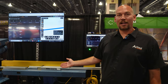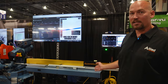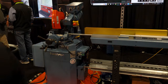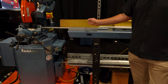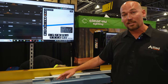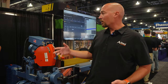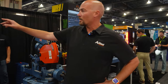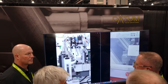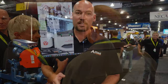Hi, my name is Brian Nickel, I'm the CEO of Allied BIM. We are a model-to-machine manufacturing system - from Revit to machine. This is a Scotchman CPO 350, a semi-automatic linear positioning system. Our software takes a Revit model and converts all of the electrical components into fabricatable pieces. We process all of our conduit, Unistrut, and all-thread directly through this system, and we inkjet all of the bend locations and instructions on every element - we have a patent pending on that process. We also have a partnership with Kripa, who have been developing a CNC tube bender that allows us to process all conduit lengths from a data matrix where we can scan it, load it, and bend it. We can bend half inch all the way through six inch EMT, IMC, and rigid in less than 45 seconds per stick.